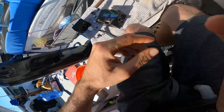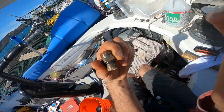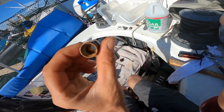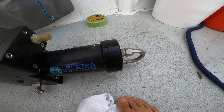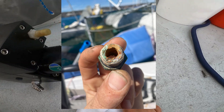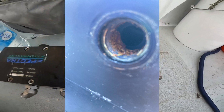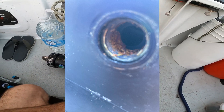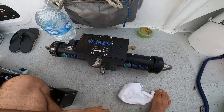We're probably going to replace them with 316 stainless steel fittings. Spectra says not to do that due to crevice corrosion, but the nickel bronze fittings have been having problems putting little flakies in your pistons and scoring your piston cylinders, kind of messing up the whole unit. I think a little crevice corrosion and replacing a center block is a lot better than redoing the whole thing.